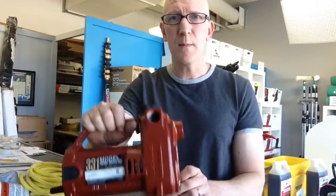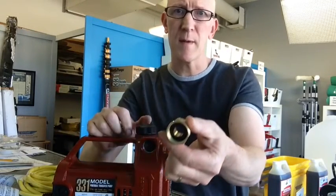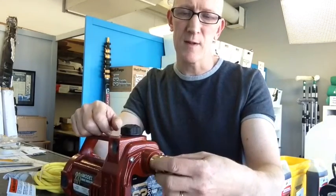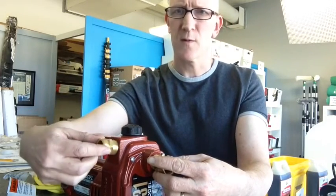When you do get the pump, it comes with brass fittings which will have to be inserted. The female garden fitting will go into the front, and you'll want to put some plumbing tape on there so that it screws in securely. Then the output port would screw onto this side.